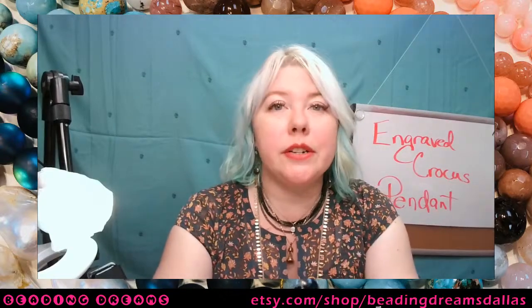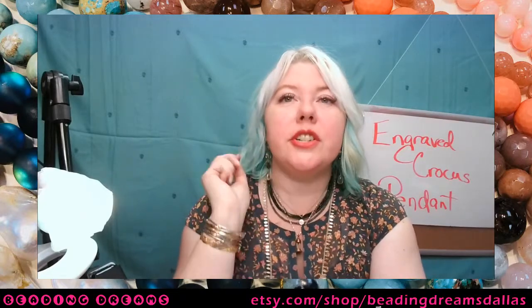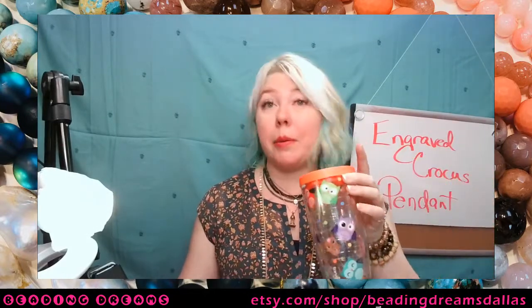The more things you pickle in your solution, the more free copper it will acquire, and the less well it will work. You can tell your pickle is reaching the end of its lifespan when it starts to turn green or blue. That means that it's pretty much saturated at that point with copper ions, and at that point you really should neutralize it with baking soda and just pour it into a jug. Once your jug is full, take it to your community's hazardous waste disposal. They will know how to properly dispose of your pickle.